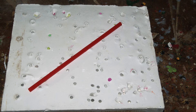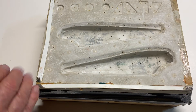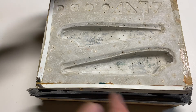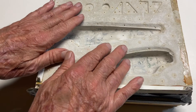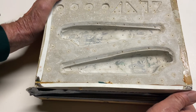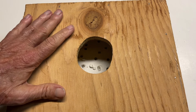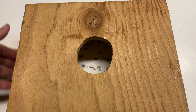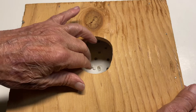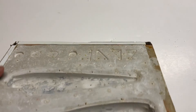The top of the poured mold should look something like this after you've removed the wires and the straws. I put plastic strip around the edge so that when you place the plastic over this and apply a vacuum, it will seal around the edge and allow the vacuum to be drawn inside. The mold is mounted on top of a box-like structure and the vacuum cleaner connects here — this area around it has to be airtight so that it can pull a vacuum. This is done with what else: duct tape.